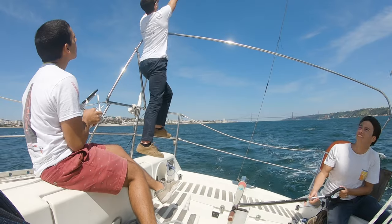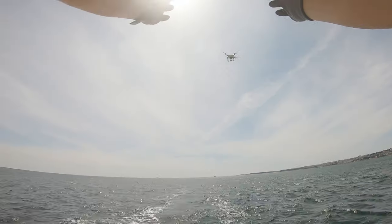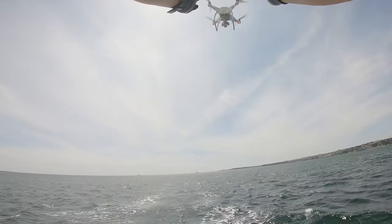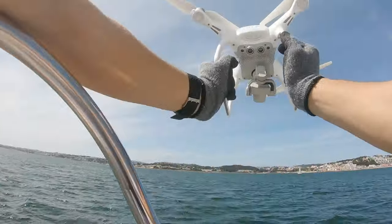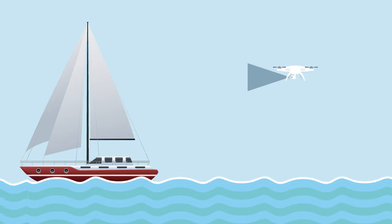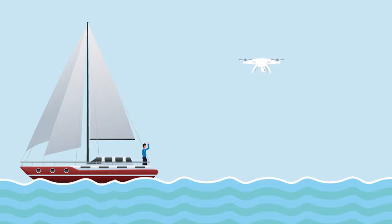I normally fly in Sports Mode or Attitude Mode. If there are wave conditions, ask the person catching the drone to go to windward so they're in the higher position when the wave comes. Ask them to put their hands up higher than their heads and wait for the drone — when it reaches them they should secure it and keep holding on until you turn it off. For the final approach, bring the drone to the back of the boat, spin it 180 degrees, and ask the person on deck to go to the stern to windward with gloves on and hands raised.